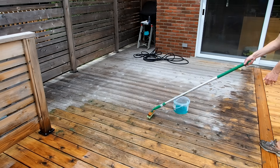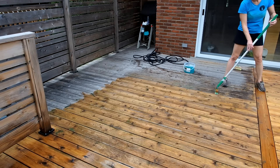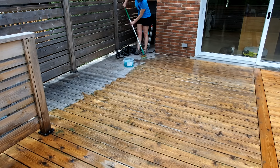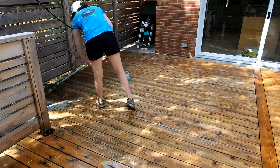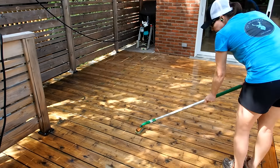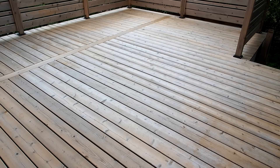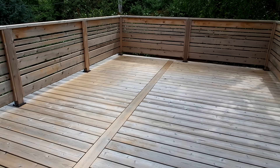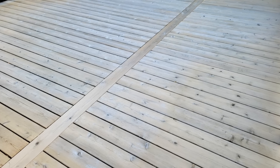This deck has never been stained, but the mistake I made is not finishing it the very first year. You should never apply a stain or finish on a brand new deck — ideally you want to wait at least three months to let that new wood fully dry so it'll take on the stain, but try not to wait three years like I did. As the deck started to dry it was looking so much better — no more water stains, no more grey, just bright clean wood. In 48 hours I'll be able to start staining it.